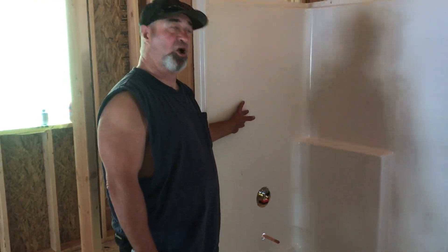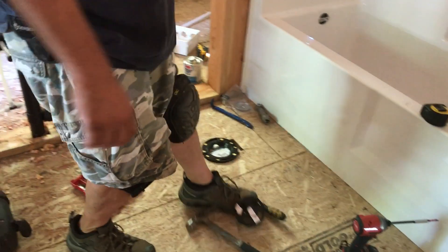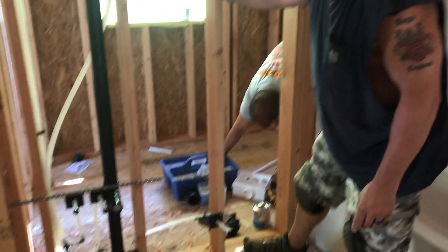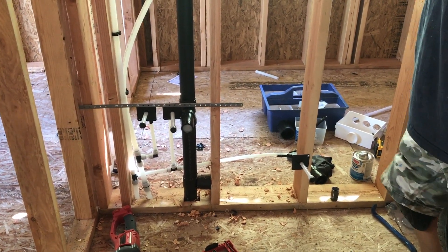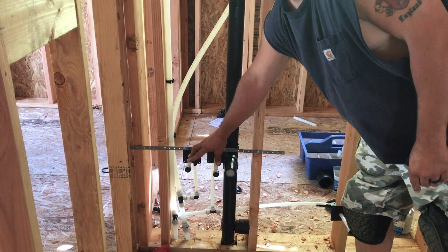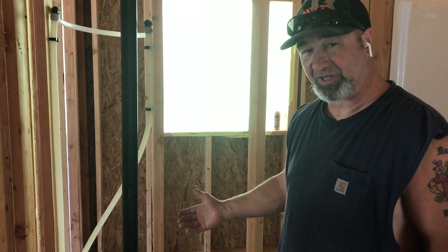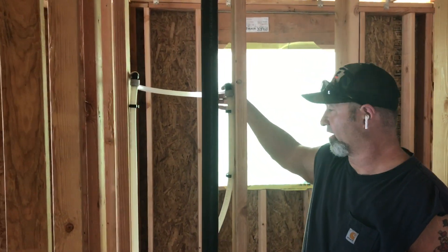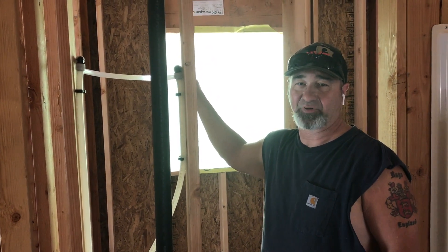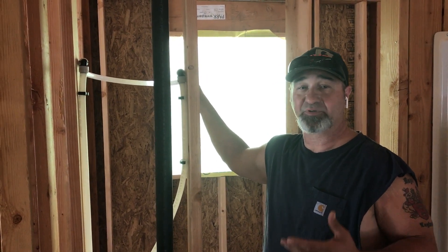Here's our shower unit installed. Here's our shower valve installed for the rough plumbing. Here's the toilet flange installed to set the toilet on during finish. This is the water stub-out for the PEX angle stop that will supply water to the toilet. Over here is our bathroom sink stub-out and our two water lines for the faucet — all the rough plumbing in the wall for future finish plumbing. Behind here we will have a heat pump style water heater, which is 97 to 99 percent efficient. It uses the ambient air temperature to preheat the incoming water, which helps reduce electrical cost.